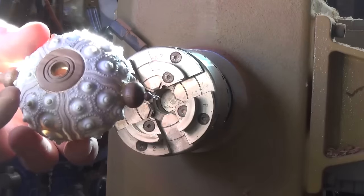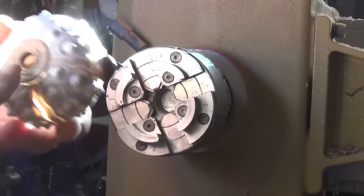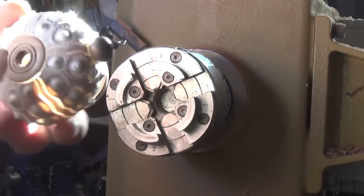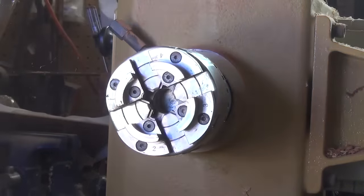We just made a round disc, epoxied it in. Well, first I drilled a 1/2-inch hole, then I chucked it up on the lathe and made it round and smooth and polished it up. And then that T-light will go in there. And then this will sit in here like this. So I'm going to show you how we do that.